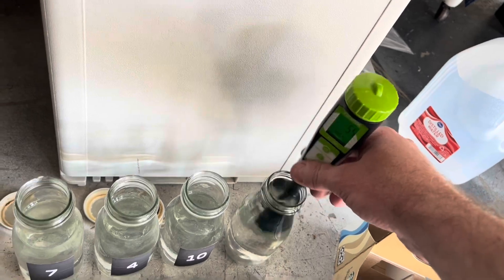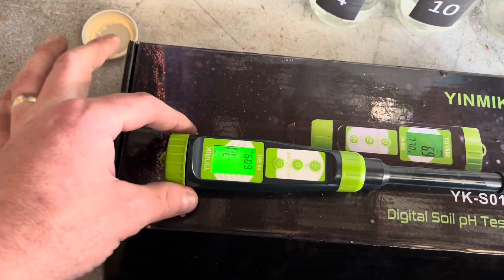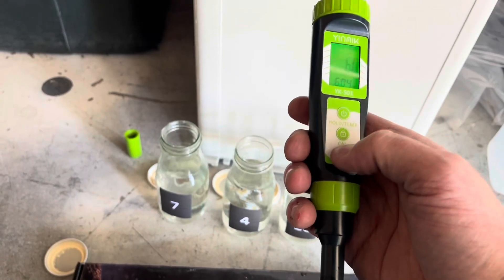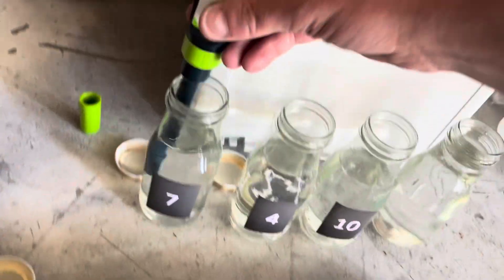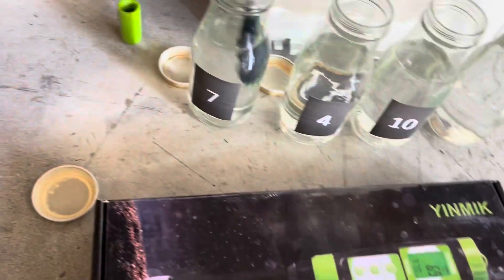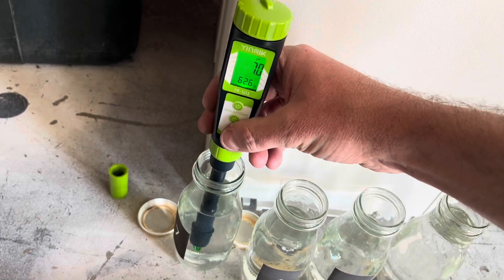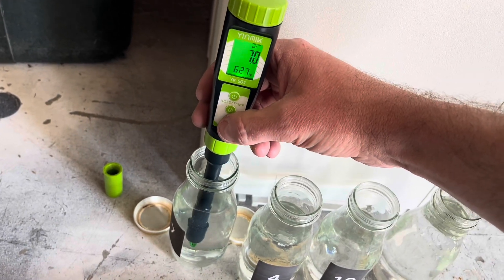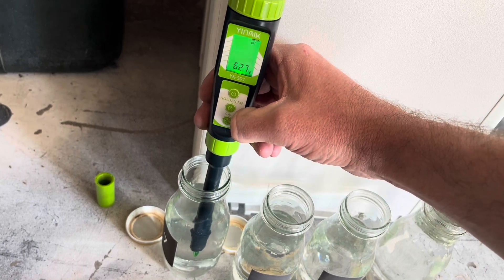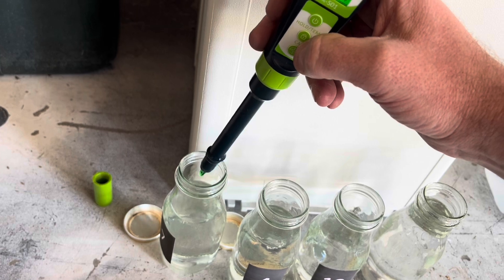Before I start any calibration, I want to get the electrolyte off the tip. I'm going to change the batteries real quick — okay, I got new batteries, made a big difference. They are coin cells; I never liked when a company puts coin cells in a tool. To calibrate this, you never want to hit the calibration button until it is settled. Go into the calibration solution and stir it — be very careful with the tip, it's glass and fragile. This one comes with an extra tip. You can see it's reading 7; I didn't tell it it was 7, it knew it was 7. I hold down the bottom button when it flashes three times, and I don't hit the calibration button until it's established and stable. Then rinse it.